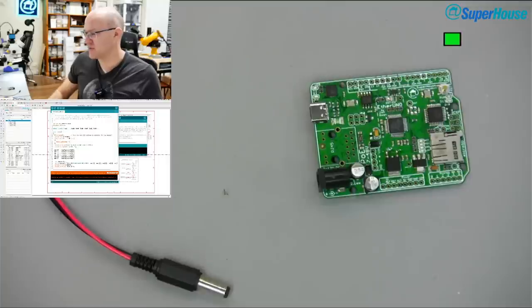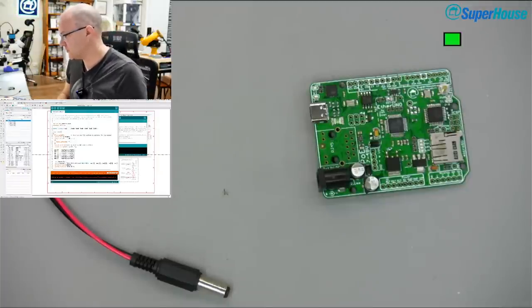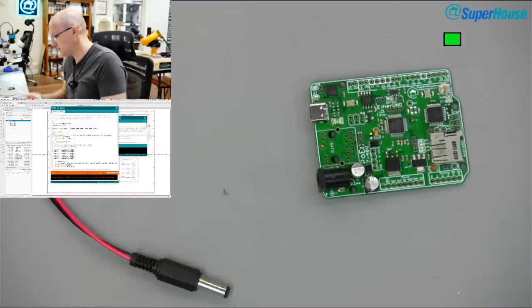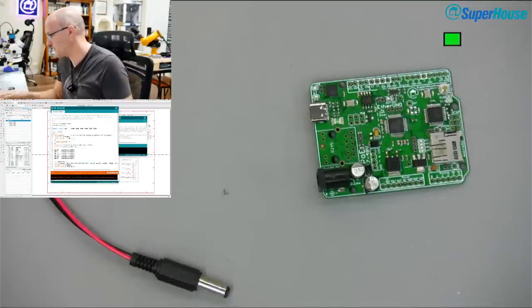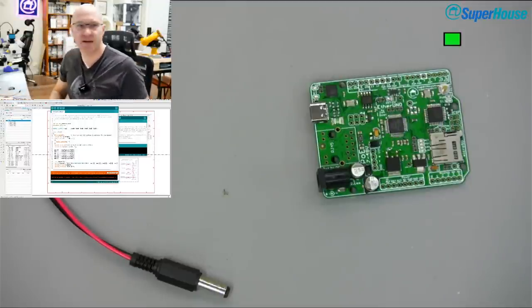So with that, it's solder paste that you can put onto a board and leave up to 24 hours before it goes into a reflow oven and it should still perform properly. With most solder paste, it needs to be done within an hour, a couple of hours. And if you've got a very large number of parts to place, as Station 240 said, like a board with 100 parts on it, it can take hours and hours to put all of those parts on by hand. So having solder paste that you can leave exposed to the air for a long period of time is useful.